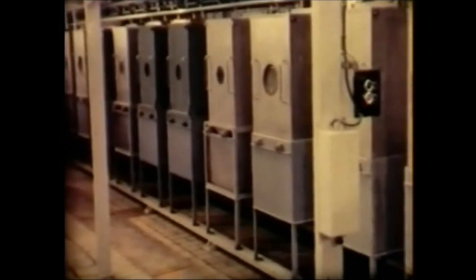Thin metal sheets for the shadow mask. They are passed through a degreasing plant to clean them thoroughly. They then arrive in a dust-free room illuminated by sodium lamps. The photosensitive emulsion with which both sides of the sheet are now being coated is unaffected by this yellow light. The wet coating is dried in a carefully controlled atmosphere.